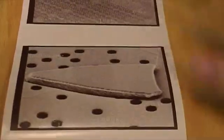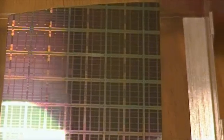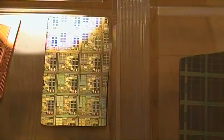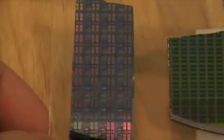A few more crazy oxide flakes and a shadow left where one came loose before this picture was taken, plus some other crazy defect pictures — some little, some big old nasty defects. From the last video: SRAM right here — static random access memory — has some logic in the middle of the chip and then some little memory modules at the left and right sides. This guy is a DRAM, dynamic RAM, basically just one big memory chip. This one has some logic and some memory areas in it, and this one is a static RAM.